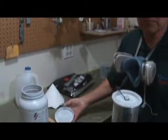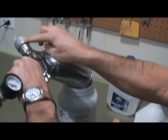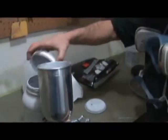That's got the wing primed. We're going to let that set, come back tomorrow morning, Scotch-Brite it off, blow it off, and put the insignia white on it. When you're through spraying, take what's left in the spray gun and put it back in the paint container since it's a one-part material. Open the fluid control valve almost all the way out and pull the trigger — that lets the paint in the cavity drain back out so you don't waste it. For cleanup, use a bucket of water or a sink — it cleans right up with water.